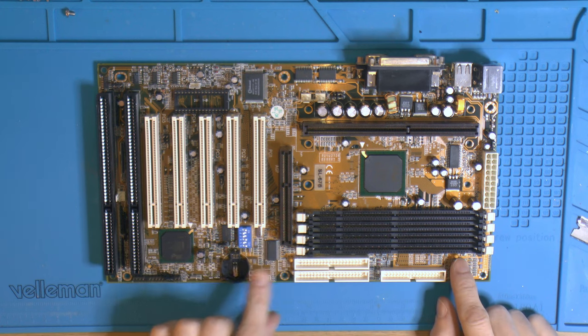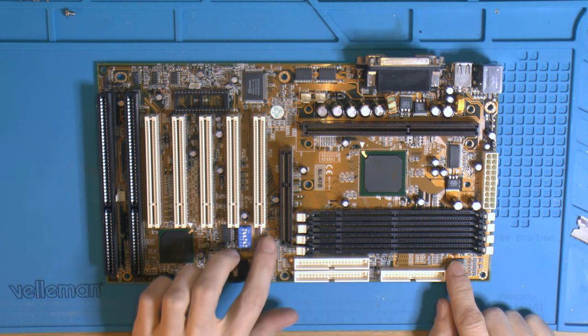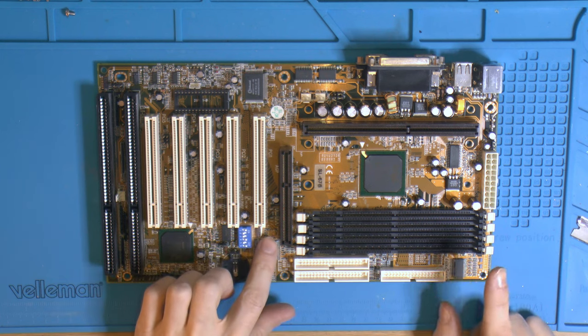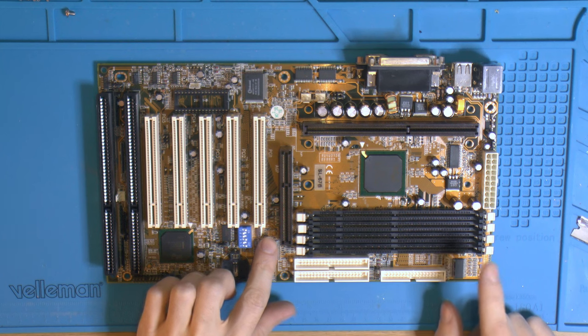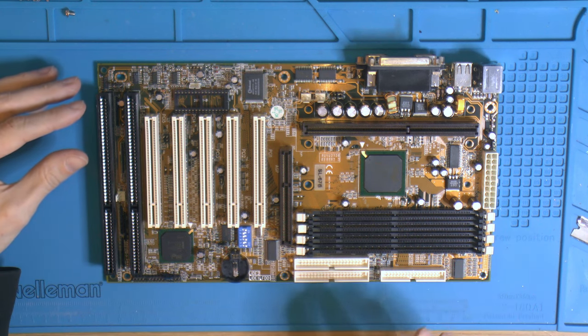So this is 12 volt rated. Just in case, I could have measured, but I forgot. So I figure we could actually measure the capacities on these. And there should be nothing higher than 12 volts on the motherboard anyway, so buying 16 volt rated polymers should be fine. So that's one thing I want to do.